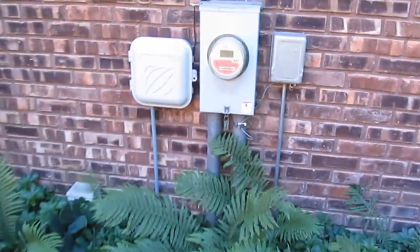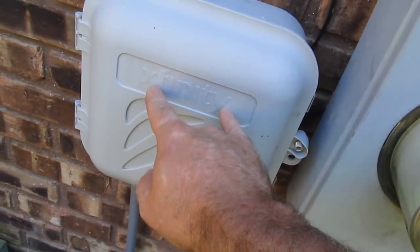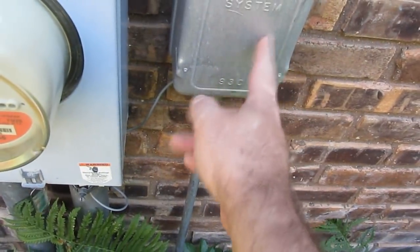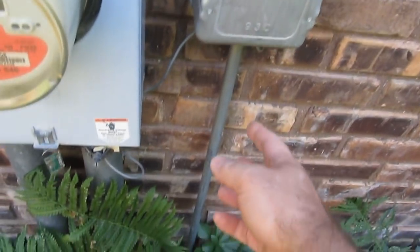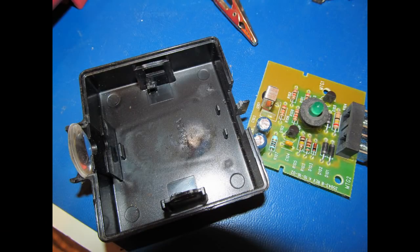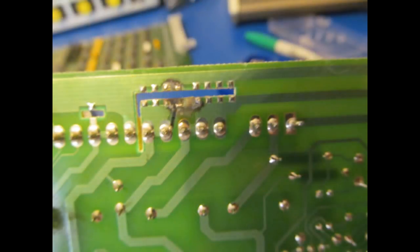The actual transformer for the house is located on a different path going across the neighbor's yard — there's a central transformer that feeds several houses in this neighborhood. You can see they have a ground strap across the top of this cable box. Inside this box they have a through connector, essentially like a splice, and that has a ground bond on it. This box is not connected since we use VoIP. When that tree got hit by lightning it blew the cover off of this box — that cover was located clear over at our neighbor's house. We lost two light bulbs and the garage door opener. The garage door opener has two spark gaps about a half inch long; it actually arced across those spark gaps and burned away quite a bit of the circuit board.